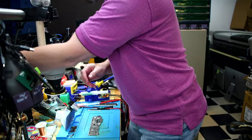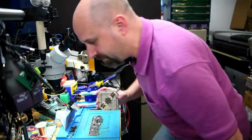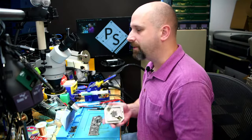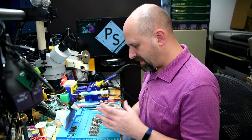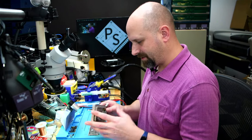This is my 1707 GPU, which I got off of a donor board that had a dead CPU. So this should be a good GPU. I just got the stencils for it all and everything, so I need to go ahead and replace this. I might do a stream of it, or maybe just a video of it. I don't know. I'm scared of the whole process.